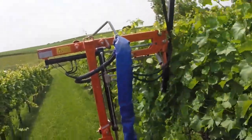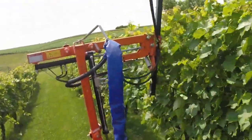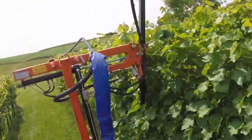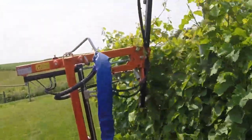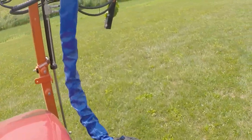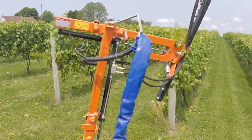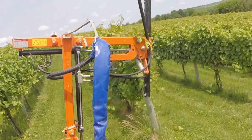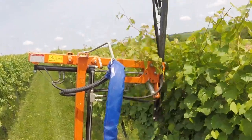When I first came out and ran this trimmer, I didn't have the bar set up at the height it is now. So when I first trimmed, I was a little lower to my fruiting zone than I normally like to be — hopefully that hasn't caused any issues. It did help open up the drapes a little bit. I'll turn this off for a moment and change the pitch on this bar just to compensate for the angle of the hill — I just want a little less aggressive pitch. Then I'll turn my cutter back on and go run up here.